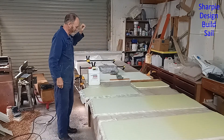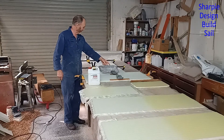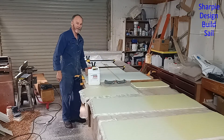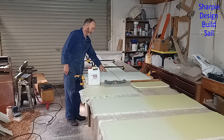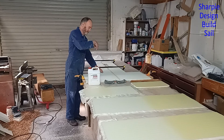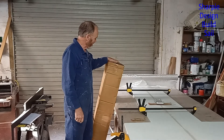The cockpit sole — the cockpit floor — has been joined. That's one of the few joins I've had to do out of all the sheets I bought, which is really good. There's a join down the middle which I didn't like, so I just joined it with epoxy with some fairing filler in it. I've got to cut a hole in this today for the hatch, bore some holes and fill them for the screws, and I also have to carefully locate where the chain plate will go for the mainsheet, which goes through the cockpit floor.